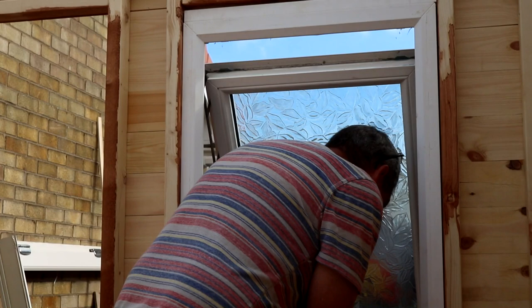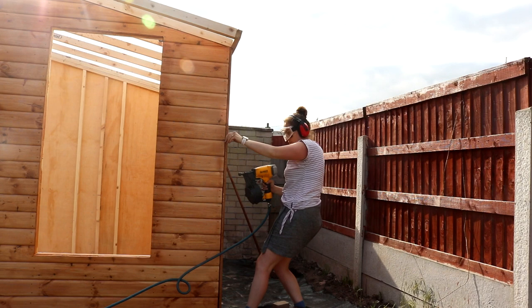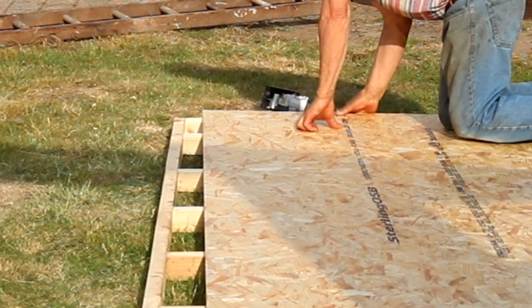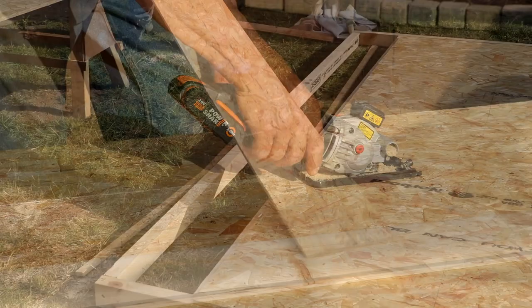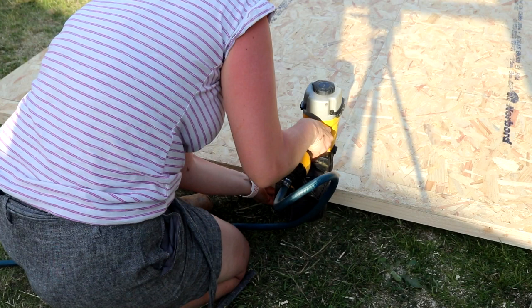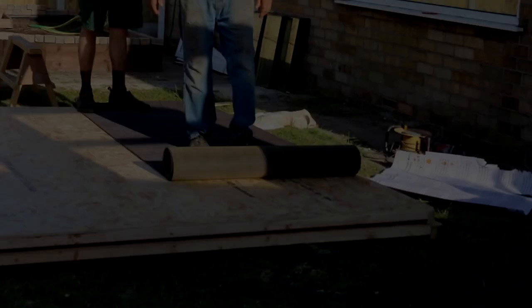You might notice that one of the roof sections was on top of the shed, but we decided later to felt it all at ground level. There's a big difference in weight by the time the felt's on. I nailed strips of OSB down to the framework, then rolled out strips of torch-down felt. You'll see a lot more of this felt in some very exciting upcoming videos.